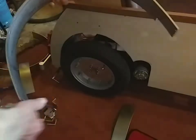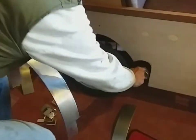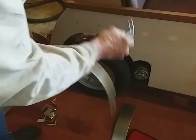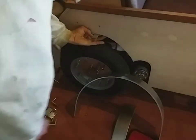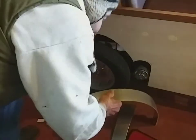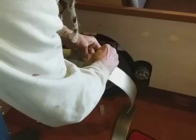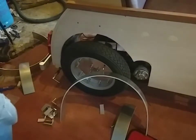I'm hoping to fix the mudguards on today. I've cut a bit off because it was too long and curved, and straightened out the ends to make it fit over there. I've got to clear the suspension travel, so I might have to chop a few more bits off. I've made up some brackets and I intend to screw them from the other side, then drill through and use stainless coach bolts. I'll need to file out the square holes so they sit flush — it's time consuming but if you want it done properly it takes time.